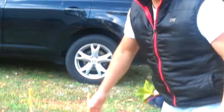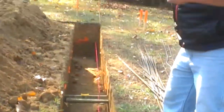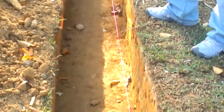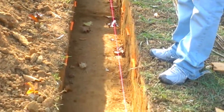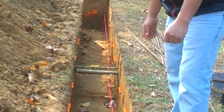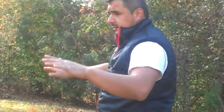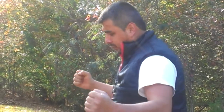In this case we have 12 inches — I like a strong construction. We're reinforcing. If you look over there, you can see how nice the spread is. We have decent flat shovels for cleaning the edges constantly, and we put little metal sticks with a bit of spray paint to show how deep to pour the concrete. We excavated a little bit deeper than normal since we have a terrain that is somewhat uneven.